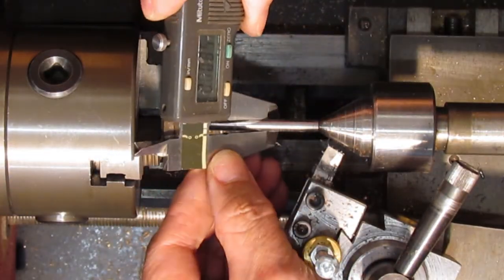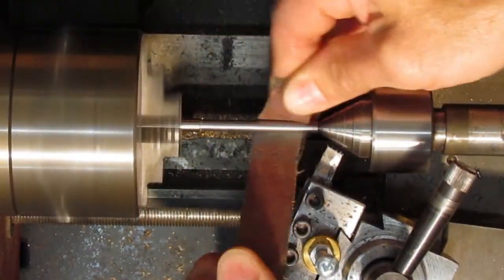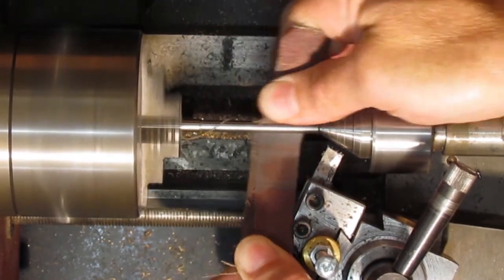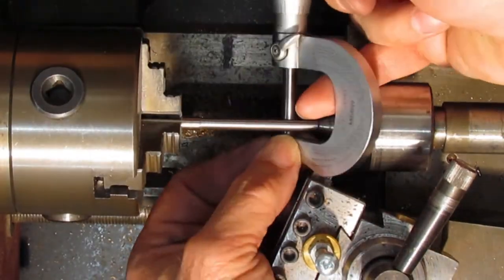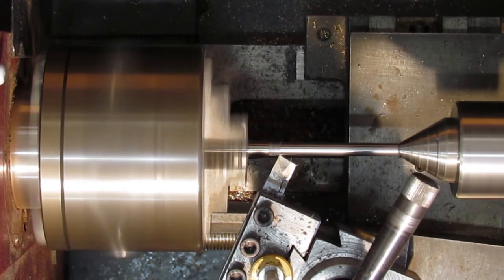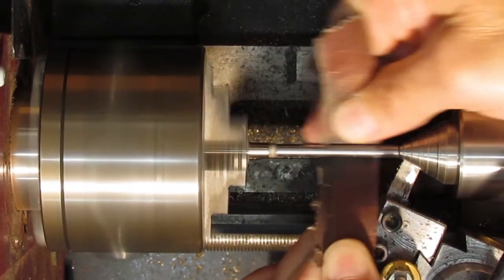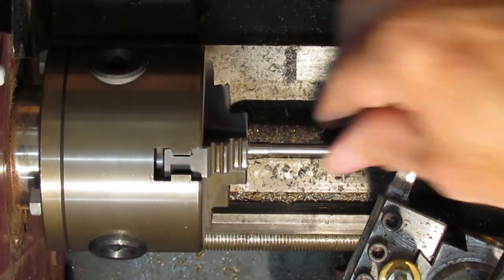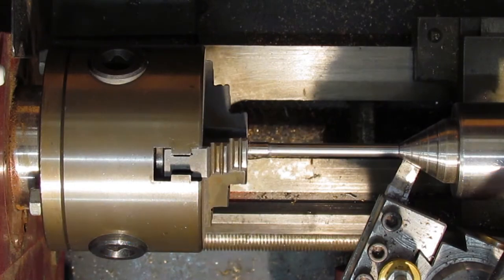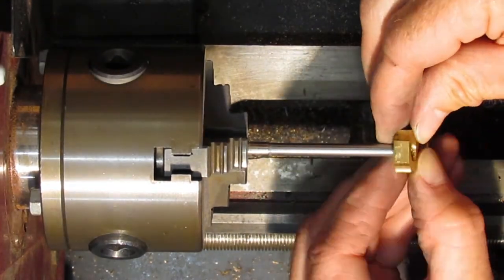It isn't an issue as I will bring the shaft to its final size using emery cloth. Using a caliper to measure until close, I switched to a micrometer to get a more accurate measurement. It is a bit of back and forth between sanding and measuring. With these little parts it's easy to remove a thousandths of an inch on the lathe. Using emery cloth takes a while to remove material as a finer grit is used when near to the final dimension. The thing to keep in mind when using emery cloth or sandpaper on a lathe is to cover the lathe ways or wipe them before moving the carriage — you do not want grinding debris between the carriage and the ways. The shaft diameter is close to final size; on such a small diameter the difference between half a thou tight or loose is very noticeable.